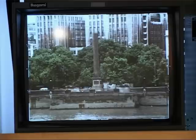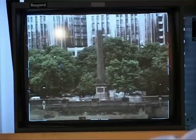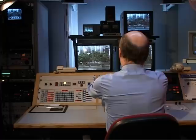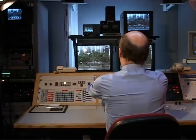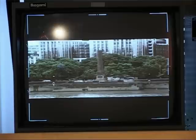The idea is that we rehearse the film through the whole programme getting the colours looking right for each scene — the DigiGrade remembers the settings — then we rewind the film back to the top and go for a recording with all the actions taking place on cue as pre-programmed during rehearsal. By moving the scanning patch raster on the cathode ray tube we can effectively zoom into the picture, pan left and right, zoom out, or go up and down — very useful for reframing captions which are a little off centre. All zooming controls can also be stored on the DigiGrade. We can also add correction for cinemascope films, correcting for the anamorphic distortion simply by altering the shape of the scanning patch on the telecine.